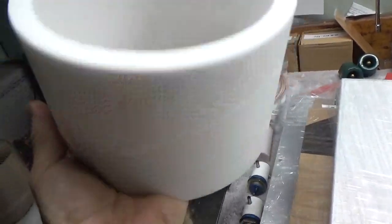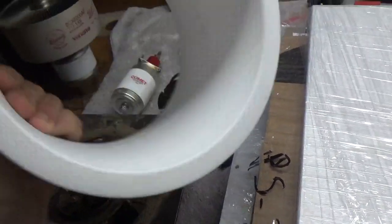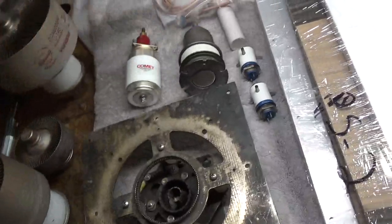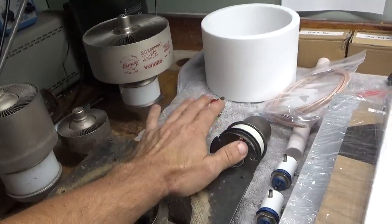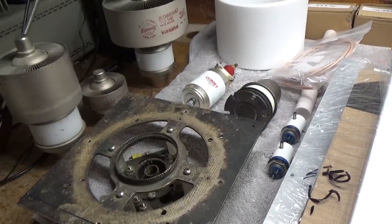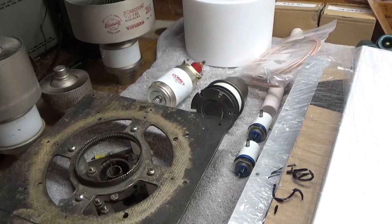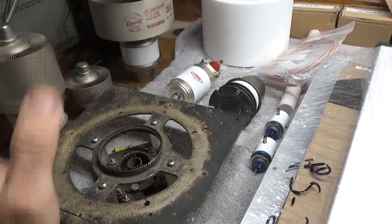Look at this Teflon chimney — I've seen people wrap chimneys with Teflon, but look how thick that is. This will be drilled and tapped with studs going through like this. Look how nice that looks. I will not be exhausting it out the top like I've seen people do — the temperature will never exceed any of the max temps for any of the parts. I don't like doing it through the top because someone could drop something down and end up with a B-positive to ground short. Plus, people like putting stuff up on top — meters or whatever — so he'll be able to put whatever he wants on top and it's going to exhaust out the back.